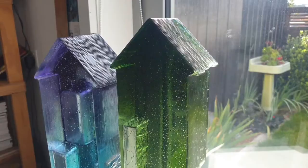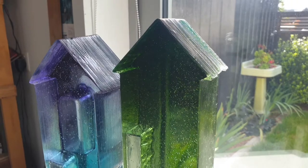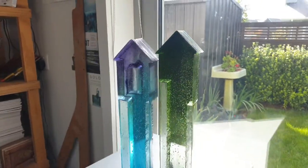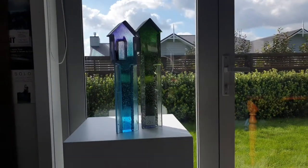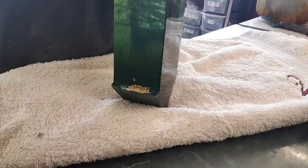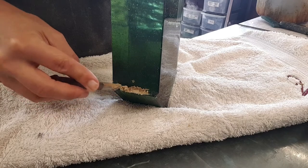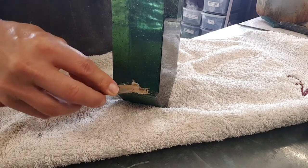What I'm going to do is put wax back into that area and regain the shape, and then I'm going to invest the glass in mould material and take it through the firing again. I will have to polish them up and go through the whole process completely again, but I'm sure they'll be as good as new. I'm taking really soft wax and I'm applying it with my knife, just building it up until it's thicker than I want.